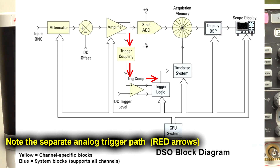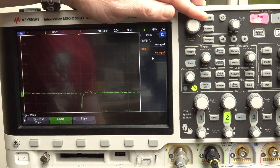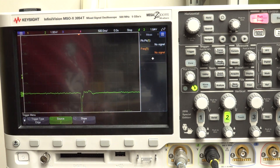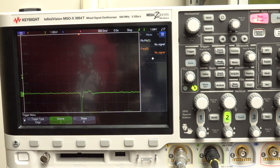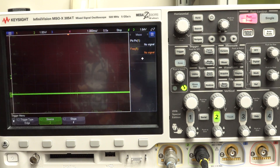What's actually going on is that the trigger system inside the oscilloscope is a separate analog system to the analog-to-digital converter and what's displayed on the screen. Especially if you use an external trigger input - that's physically a different channel, it's not taken from the analog-to-digital converter. So there can be - and this is the trap for young players - trigger signals which your oscilloscope is genuinely seeing and genuinely triggering on, but which your analog-to-digital converter is not capturing.